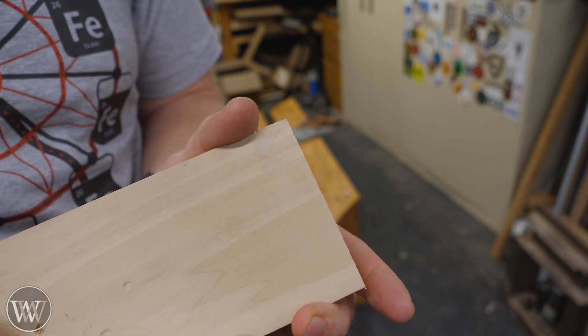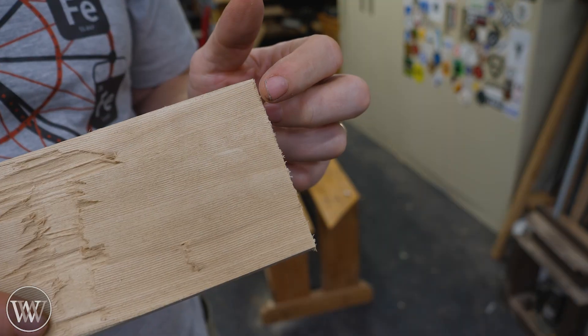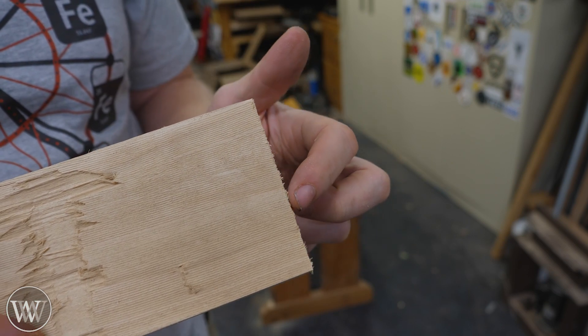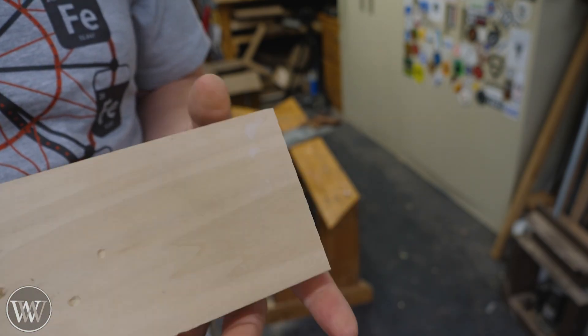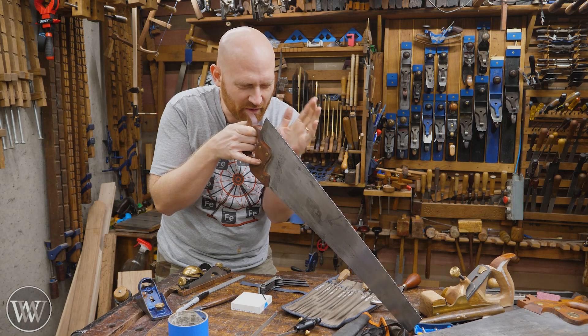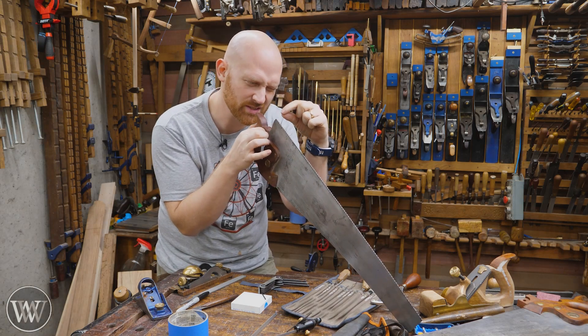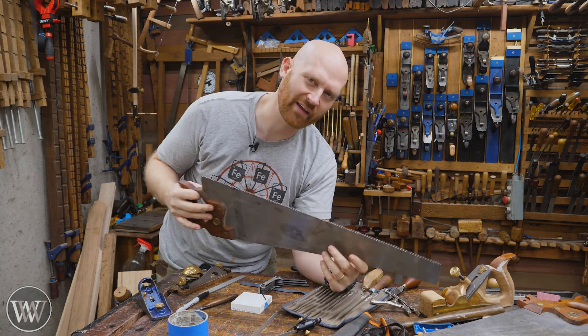You want to see a nice clean surface on the entry and a relatively clean surface on the exit. This is a fairly coarse crosscut saw, so having a little bit of ragged in there is not a problem — but I'll take that, really nice. Now if you really want to show off your skills, you get a sewing needle and set it on there, and hopefully those points should hold it and it should slide right down them. But I've only gotten that to work a few times.